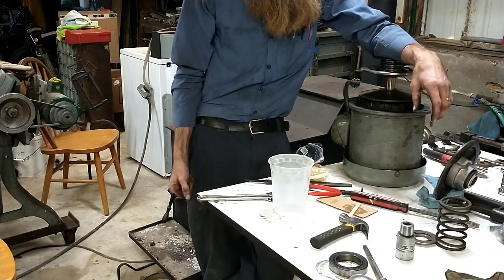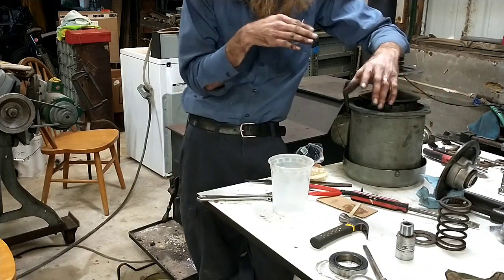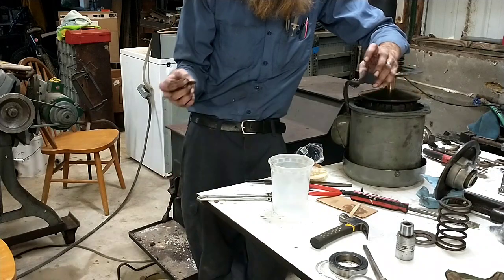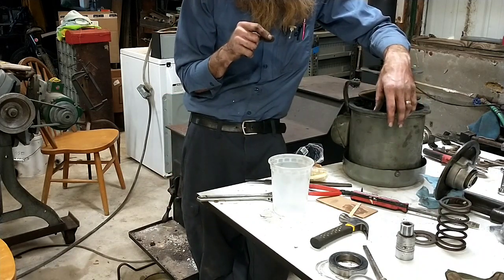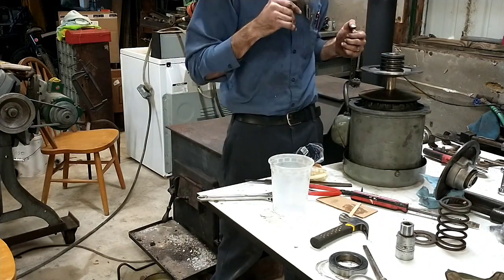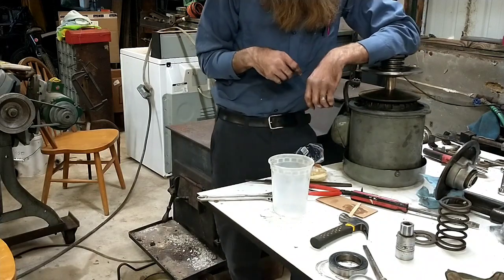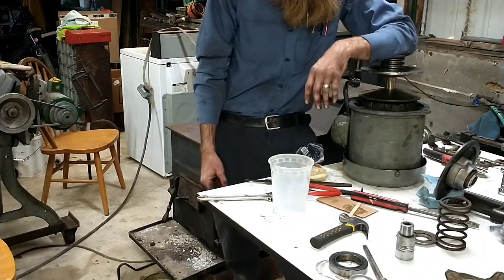Now that poses a problem, and that is, how do you get it loosened up? We go in there with a half-round file, and I don't love it because it tends to make a lot of little furries in the surface of that synthetic material. And I'm afraid that those wear back off pretty quick. So you get it in there, you get it moving, you file on it, you're basically pre-wearing it a bit. But sometimes that's just the only option you've got. You got to do it because they have to slide nice.